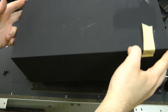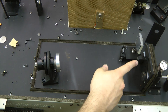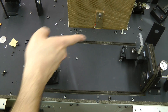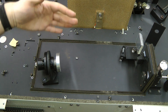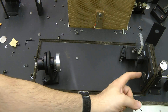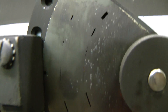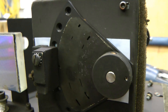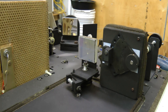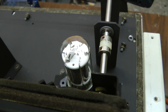Let's take a look at this. Basically what this is: there's a slit on this side, light bounces off this mirror, off this diffraction grating and mirror combo where the reflection angle depends on the wavelength, and then back across through the mirror, then to another slit. You can see the really fine slits. The middle is adjustable to wider slits because not much light gets through. A small amount gets through the first slit, it has to go through the entire optical system and back, and then through another tiny slit, so most of the light is lost. That's why they need such a sensitive vacuum tube detector.